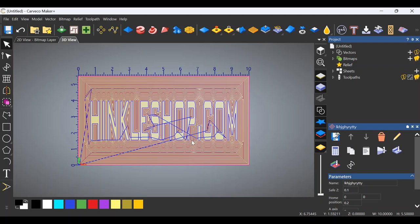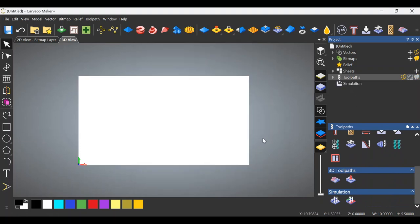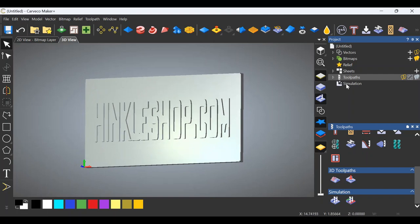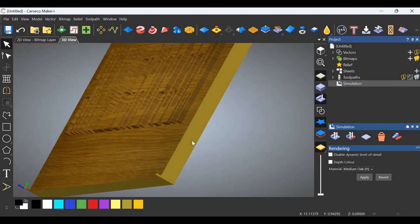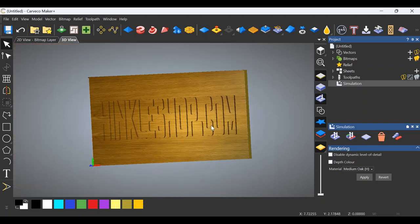As you can see, it's going to remove — let's zoom in just a little — it's going to remove everything but your text, and that's going to raise up the text. Let's simulate the toolpath so I can prove my point here. Holding down on the center button and rotating. Sometimes that's hard to see with the standard material, so we'll go back and click on simulation once more. We'll come down here on the bottom where it says rendering and change from the simulation default to — I like medium oak when I'm doing this, it seems to work well for my old eyes. Click apply. We'll rotate it again. Let's zoom in a little bit and you can see that you have raised text. That's all there is to it, folks. Create a border around your text, do an area clearance, let the machine hog away what is not the text and it will pick it up off of the surface.